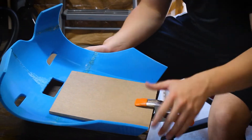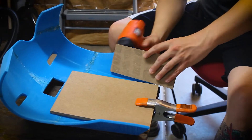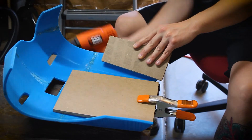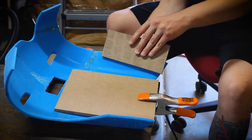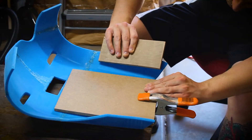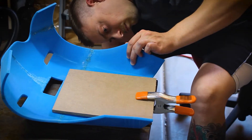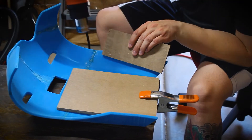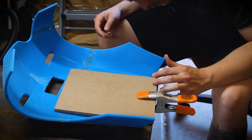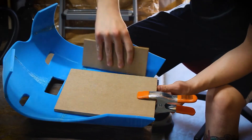To ensure that my flat parts stayed flat and my bendy parts were what was actually bending, I cut up a board from my garage and clamped the center part of the back piece onto a flat table. This made sure there was a hard flat surface on top and a hard flat surface on the bottom, so even if it started to heat up it wouldn't reshape or warp. I then worked the heat gun focusing on that main corner and lightly used the other little board to push out on the outer piece to open it up. Definitely go slow with your heat gun and don't heat it up too much too fast. When you pull it out with the board and hold it there, as the plastic starts to cool back down it will maintain its shape.